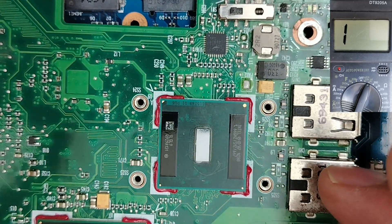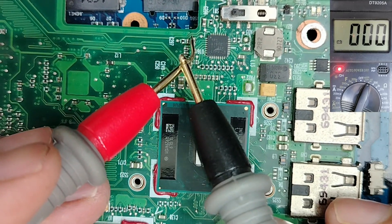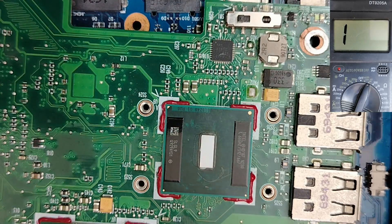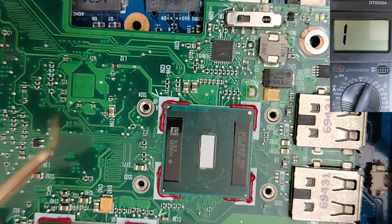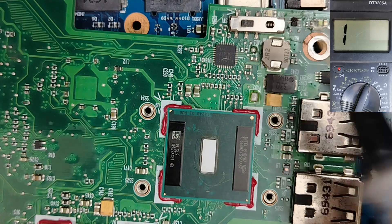What is a real short circuit? Look at the multimeter: zero, 0.001, or 0.002 — that is a short circuit. But 0.008, 7, or 22 — that is not a short circuit.